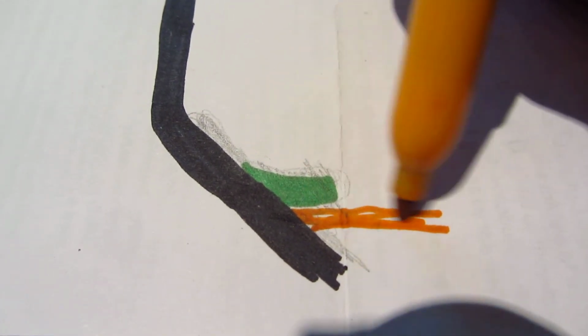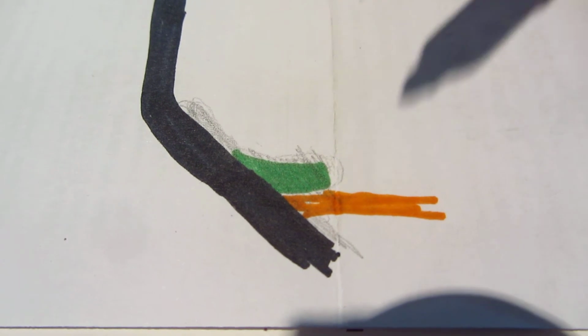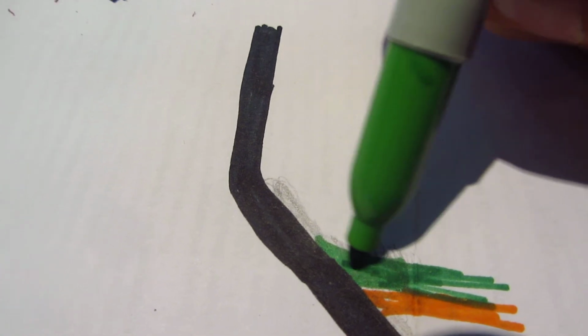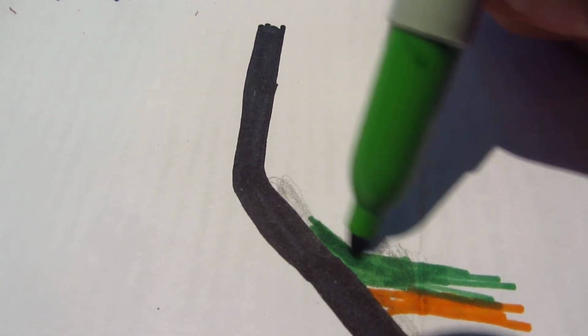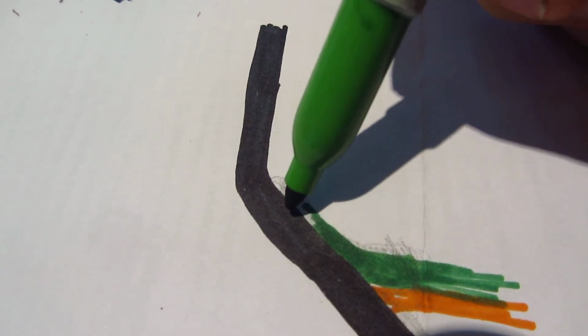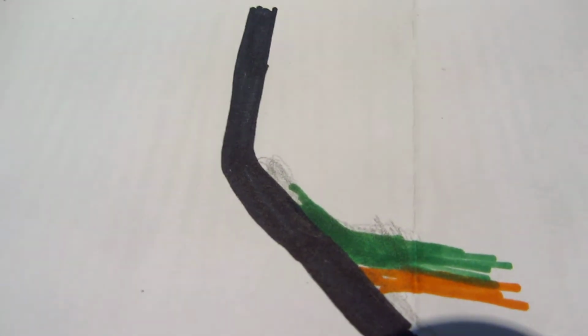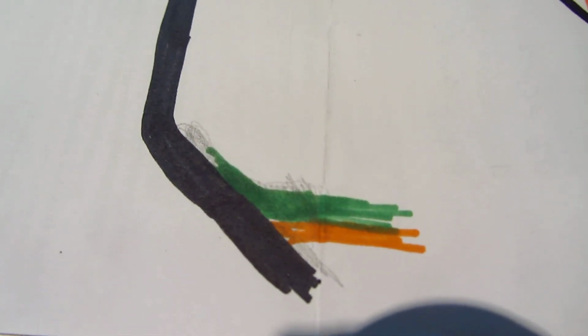you're going to need to put a new layer of fiberglass on, of course, and that fiberglass is going to have to adhere to the hull. So when you put this new layer of fiberglass down here, you are going to be coming up the side of the hull again, and you're going to want to make sure that this fiberglass on the hull is nice and clean and roughed up. So there you go. Hope someone finds that helpful.